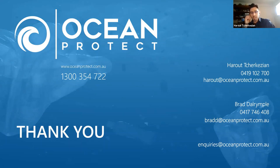So good question, Che. I mentioned when running through some of the differences that regardless of the system, the water that's in the base of the system will always drain through our system. Yes, there are some products on the market that will not drain until the siphon is fully engaged. So you could potentially have lost volume in your OSD tank if you're accounting for that volume in the storm filter chamber. So in our opinion, for our system, for StormFilter, yes, the chamber does provide OSD volume. It does contribute to your attenuation calculations, yes.